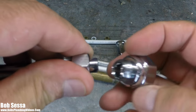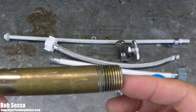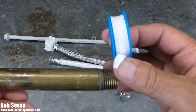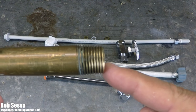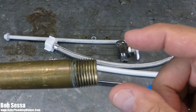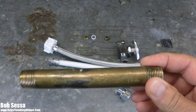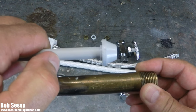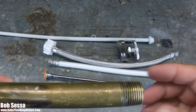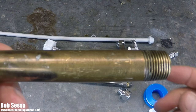And when you put it into a compression fitting and slide the nut down and tighten it with an adjustable wrench, it actually squeezes the ferrule, compresses it, and latches onto the copper tubing and pushes up against the adapter, creating a watertight seal. Prior to these metal supply tubes, when I started, faucets and toilets were all hooked up with solid pipes. We would wrap Teflon around our threads in the clockwise direction, then use a half-inch by quarter-inch reducing coupling with quarter-inch tailpieces in different sizes. On one end the tailpiece had a tapered cone; on the other end it was threaded into the female reducing coupling.